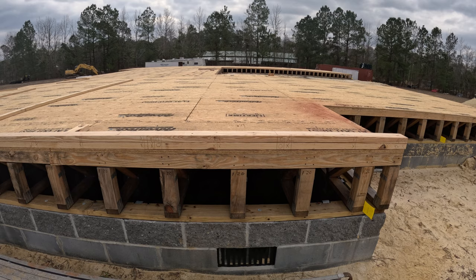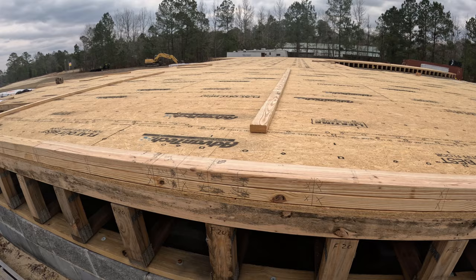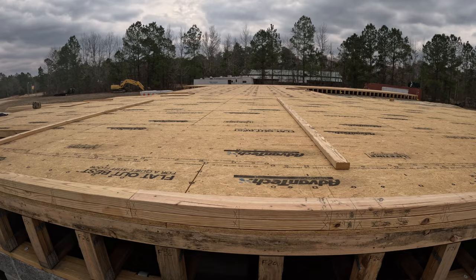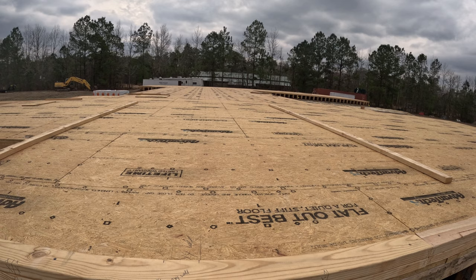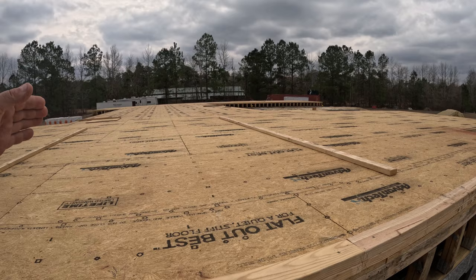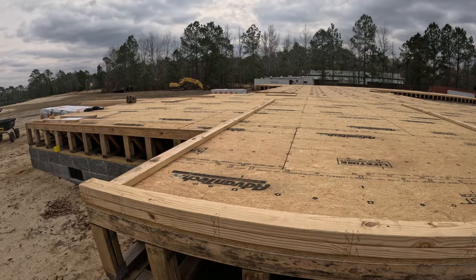And so every 4 feet, as you'll see, a double X, one on each side. That's where the wall is. So there's a wall nailer that will go in here. So when this wall gets built, it has a nailer to hold it. Same thing here. There is going to be just a short wall to divide up the closet. Just gives you more room. You have a big closet, but what can you do with it if you don't have walls? So it'll probably be like a 5 or 6 foot wall, just to have a little return there.